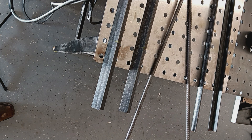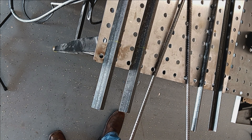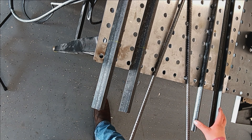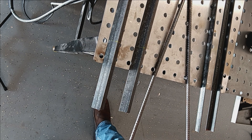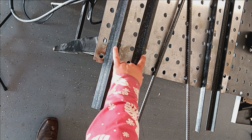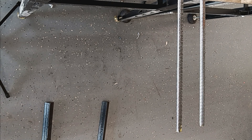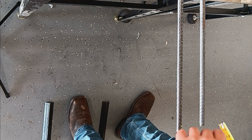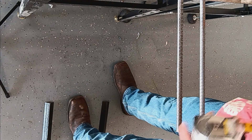Now that we have our material cut, these two pieces of rebar are going to be the main body. The one-inch angle iron is going to be what holds our backer in place — I'm going to set them at a 12-inch gap. And these two one-and-a-quarter pieces are going to be the feet that actually sit on the ground. As for the pieces of rebar, I'm going to want about 8 inches of rebar to sit inside that top piece of angle iron, so I'm just going to mark out 8 inches on both sides.